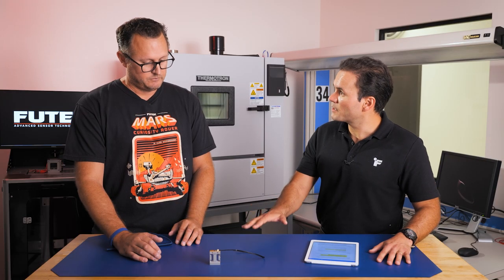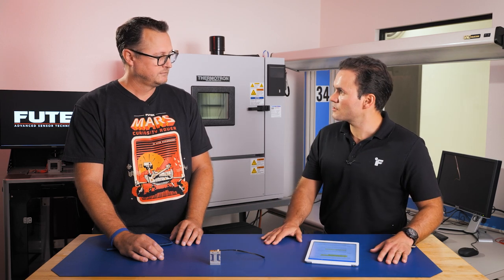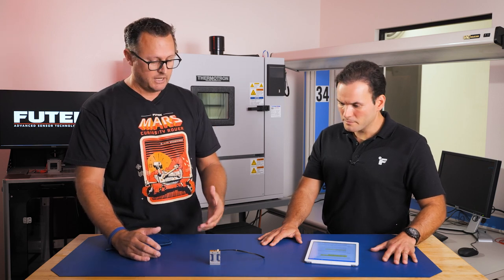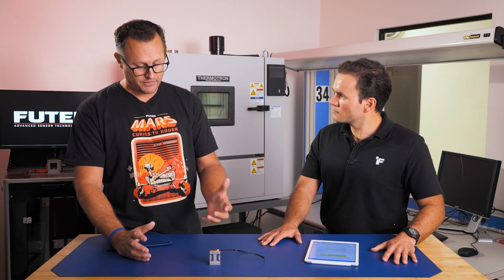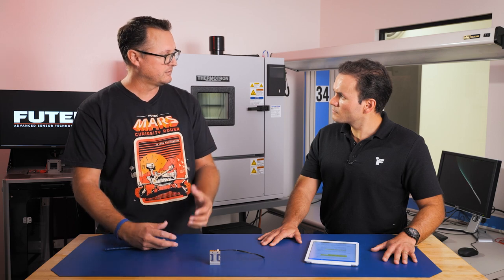Talking specifically about OEM applications, why does an OEM application need a low power consumption sensor? Again, there are certain parameters. If it's a handheld or battery-based device, it's extremely important that they get the maximum battery life out of their total system. There is a decent amount of draw that can occur from the sensor. With 1,000 ohms, depending on what their excitation level is, that can really drive it. The other part is that if they're implementing this in a critical area, we want to make sure that this isn't generating substantial heat that would then impact their complete assembly.